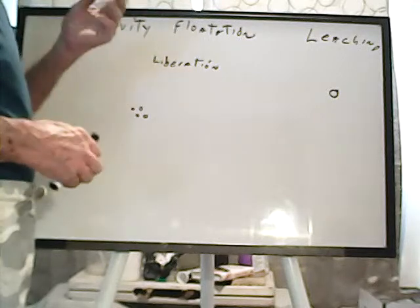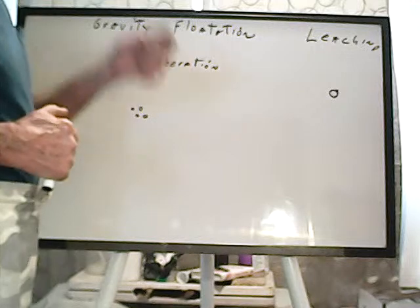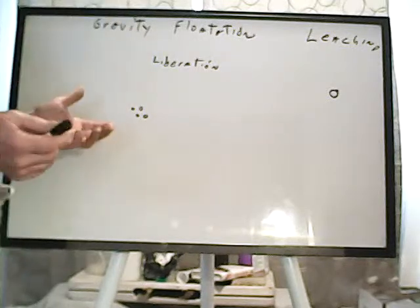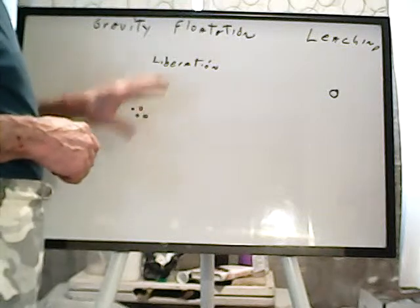You know, it costs money to grind. Yep. And so the finer you grind it, the more energy, the more wear materials you use. Time, labor, yeah, it all adds up. Your throughput goes down. So you're always trying to grind as little as possible to get away with what you want.